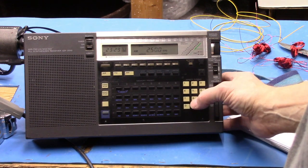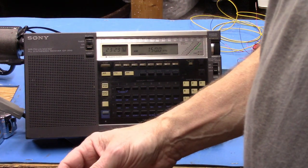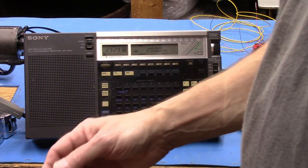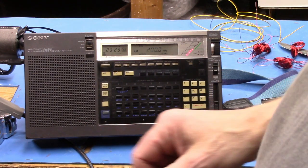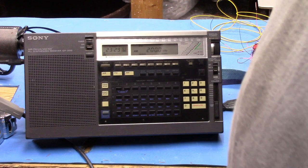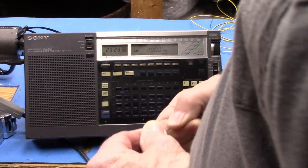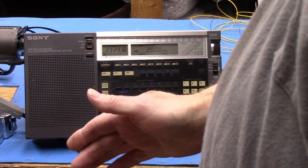So let's go down to 150 kilohertz now. Nope, doesn't make it to 150. Let's go to 200. So it resonates at 200 kilohertz now, and if you take that fixed one out, you can go all the way back up to the 1080 that we were at before. So don't be afraid to put some switched fixed ones in. If you want this loop to go from, say, 250 up to 1080, then you just use the variable capacitor.